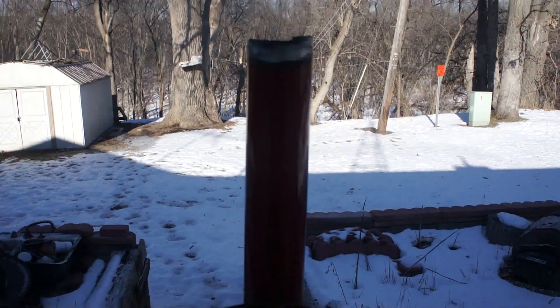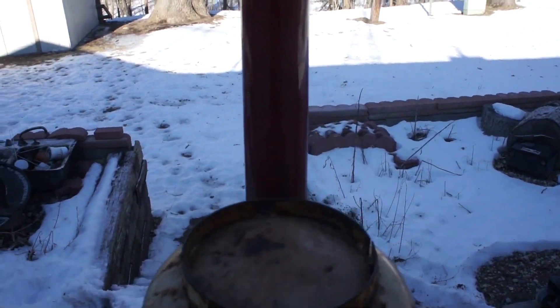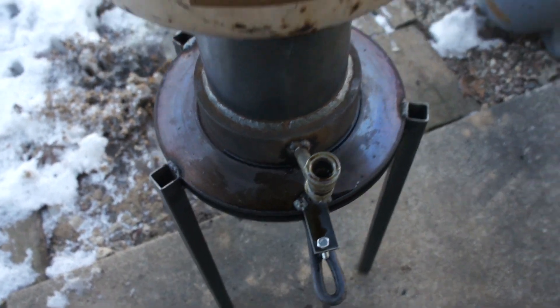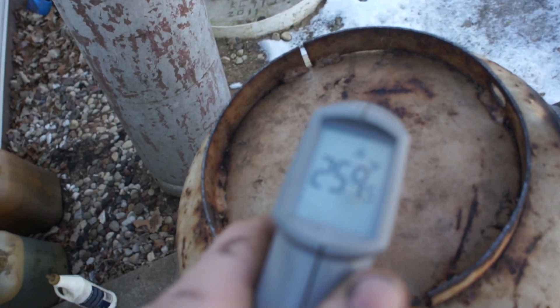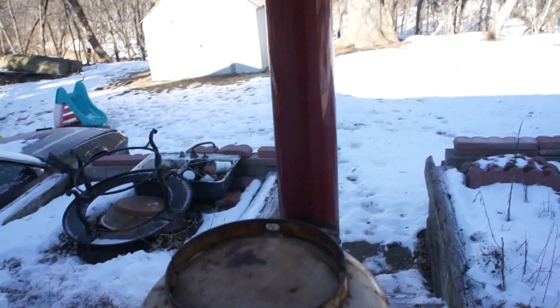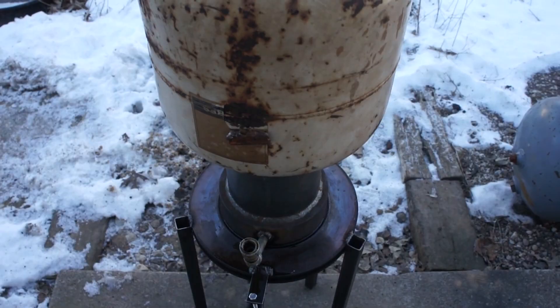Before, I had heavy black soot coming out of the pipe and the heater was full of heavy black soot. Interestingly, with it more choked — with the two-inch pipe — we had a much higher operating temperature, close to 700 degrees. We cut our operating temperature in half going from two inch to three-and-a-half inch exhaust. We raised tank temperature just a little and evened it out more than anything. With the two-inch exhaust, the pipe would only get maybe 130 degrees even when we had 700 degrees down below — an interesting balance. Running much cleaner now, but we increased exhaust flow, raised chimney temperature, and reduced combustion chamber temperature by half.